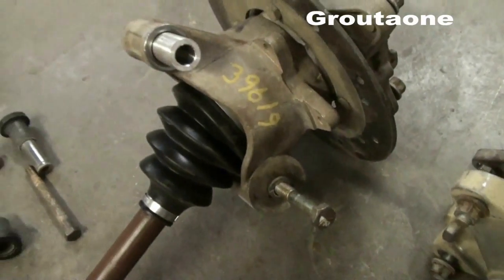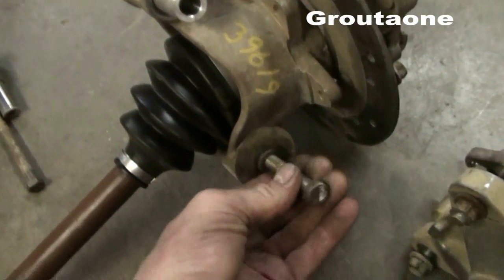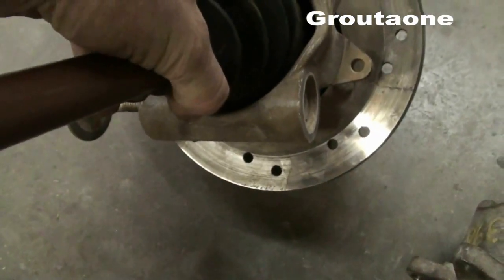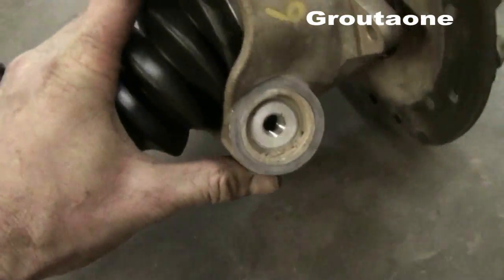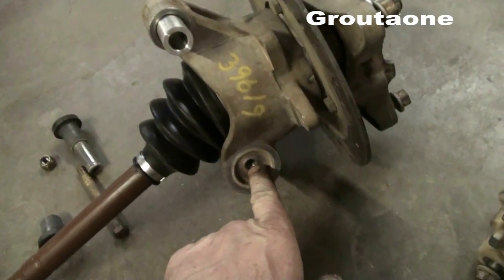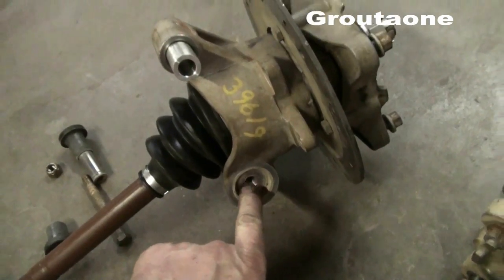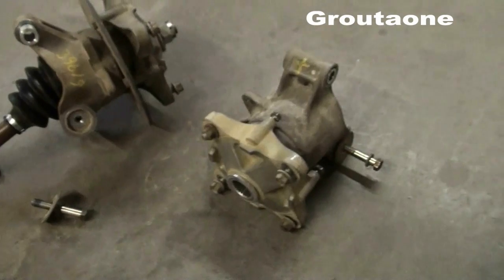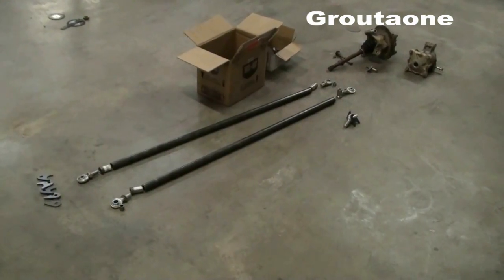But I still have the little 3/8 bolts on the bottom. There's a big chunk of aluminum that just threads the bolt right into. What I want to do today is drill these right out and tap them to a half inch hole, so then I've got a half inch mount top and bottom. That's today's project.